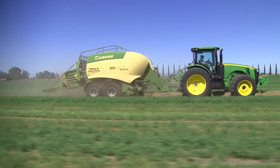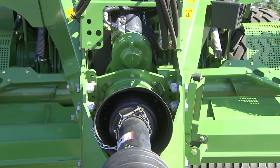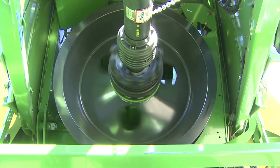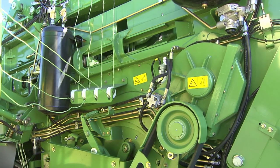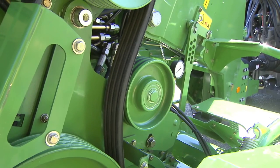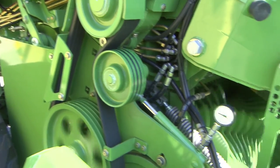The BigPak HDP2 bears testimony to a lifetime of experience and expertise in baler manufacturing. The optional hydraulic starting aid nudges the HDP2 into action and accelerates the flywheel to 300 RPM. The rotor cutter and pickup are powered via a separate driveline. Once the HDP2 is up and running, the PTO takes over, and the rotor cutter and pickup kick in powered by a separate poly V-belt. This driveline concept offers a number of clear advantages.